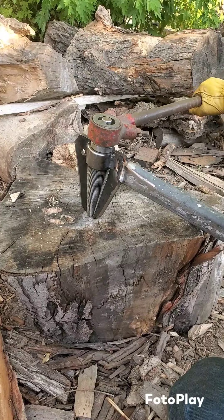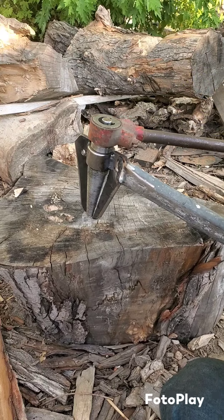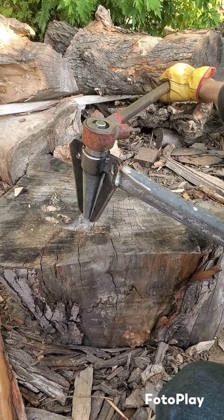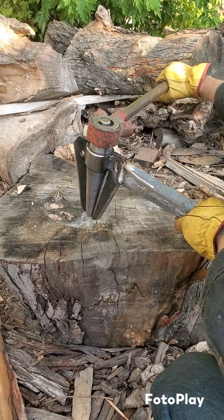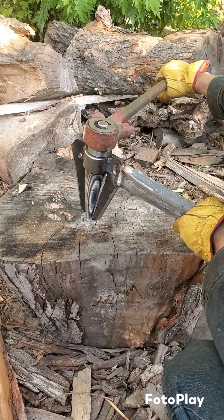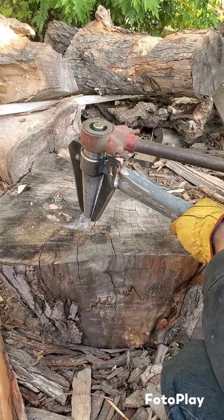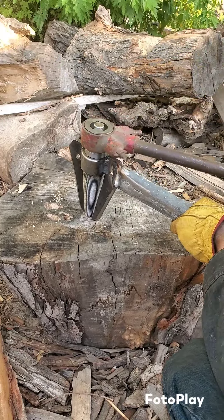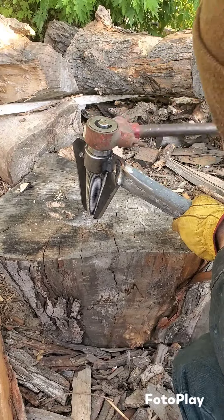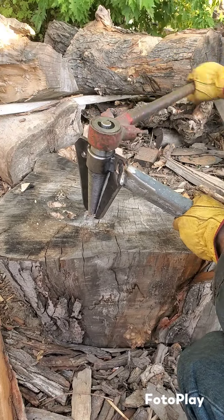Design-wise we had to change a few things. The screw with the tip on it didn't work, but the screw by itself works. I have to stabilize it so the log doesn't twist all over the place, so we'll have to make some different, tougher tines — I can already see them twisted. Also, this wood's kind of punky; at some point I'm just pulling wood out and not actually doing anything, so we'll have to see how this works on wood that isn't rotten.